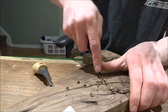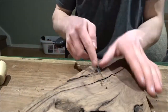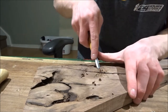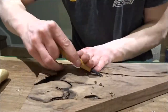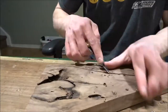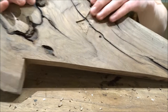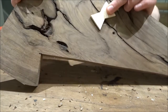It does take a long time — I've sped this video up about eight times speed for quite a bit of it, and I cut a lot of parts out just because it's repetitive. I did switch to another tool, basically a carving chisel — you would never hit it with a hammer, it's just super sharp and pretty delicate. All I did with this is try to clean up the base of the recess, make it flat, and then make the edges square. That's as simple as putting the chisel on its side and sliding it through the same line that you've already drawn.